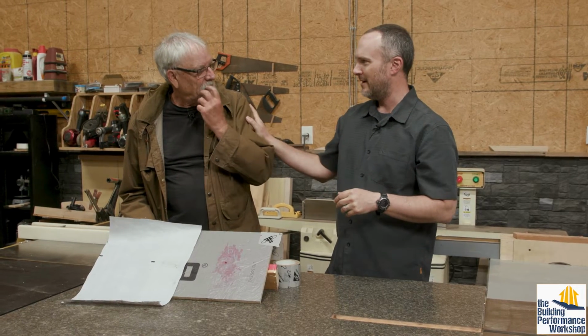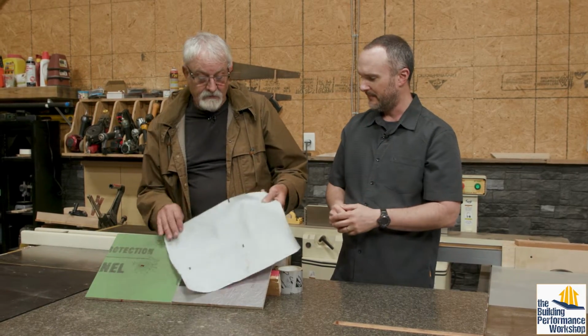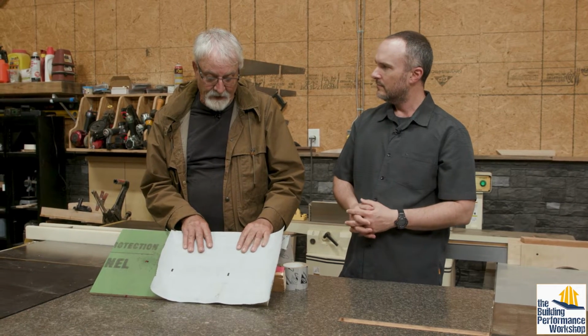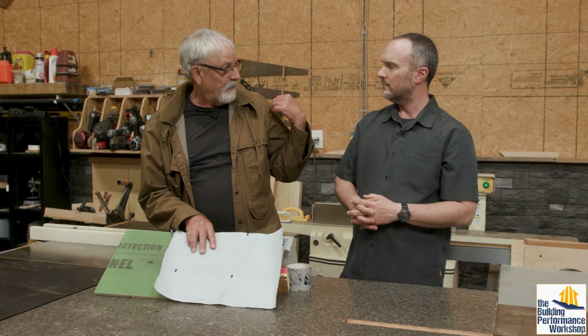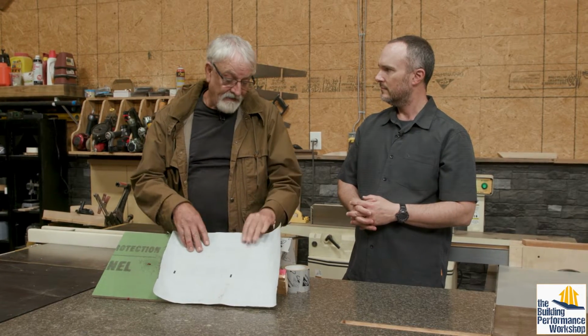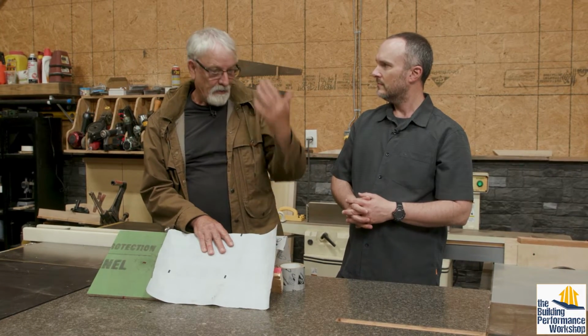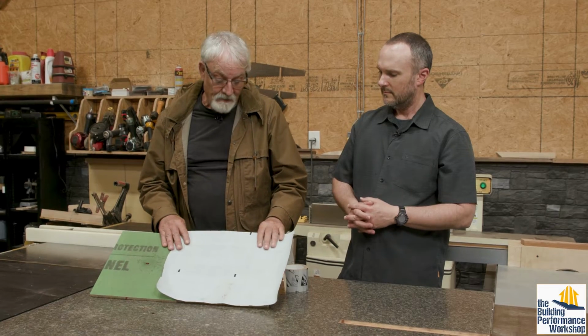And when you say vapor barrier that way, you're talking about something that controls vapor, not that blocks vapor, right? We're not talking about sheet plastic. Well, you know, Tyvek, you put that and you've got a vapor barrier on the outside, then you probably shouldn't put one on the inside. You definitely don't want a plastic type material, the vapor barrier that they do up north on the inside and on the outside. You're just trapping moisture in there.